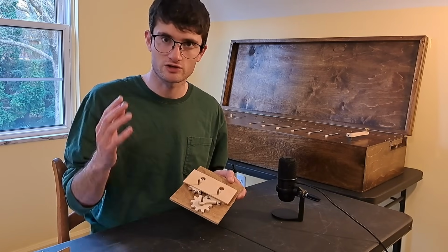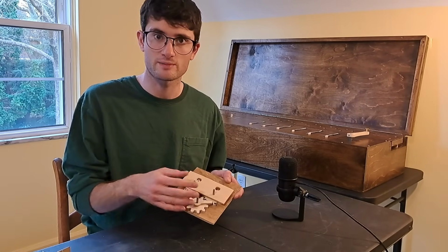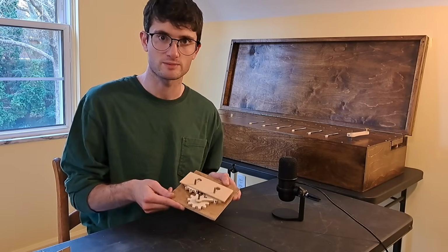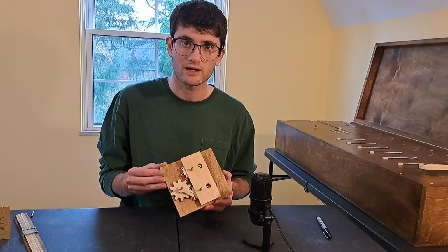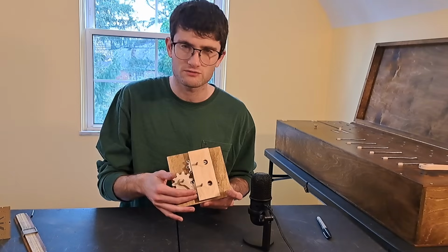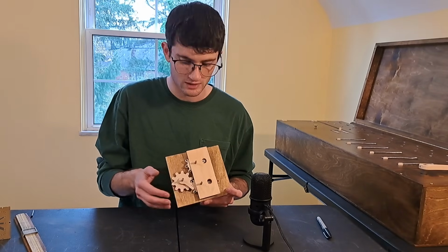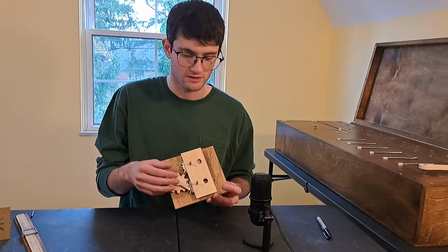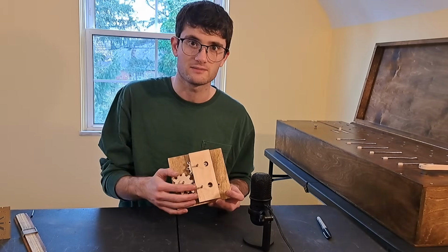But the carry isn't the only hard part about arithmetic. It can be hard to hold large numbers in our head and remember where we are in an operation, especially when we're doing a lot of addition and subtraction, which is the basis for multiplication and division. To alleviate our mind of those burdens, we need to abandon this method of directly driving the wheels, because it forces us to remember how much we've turned them. Instead, we need to have some way of having one consistent motion that could add different values into the wheels as needed.